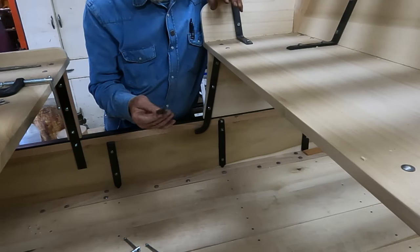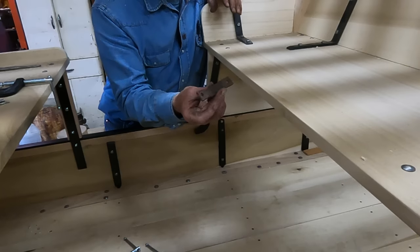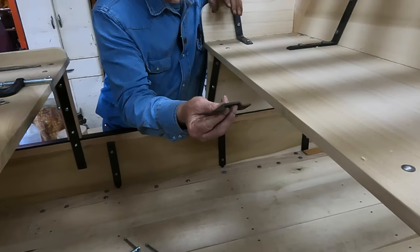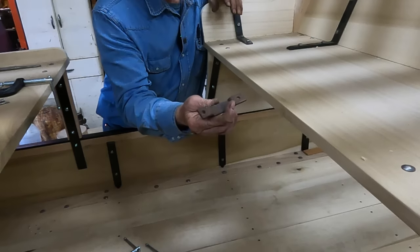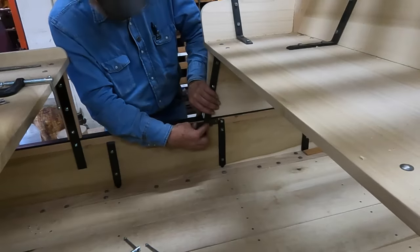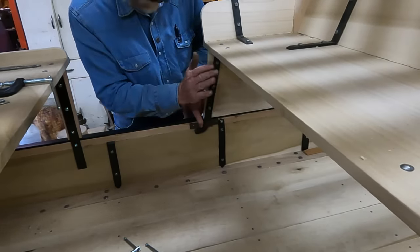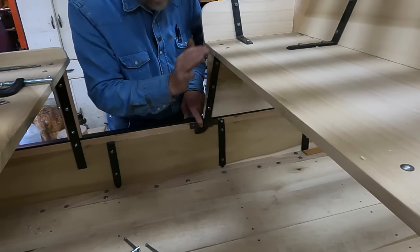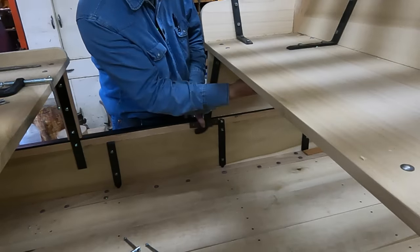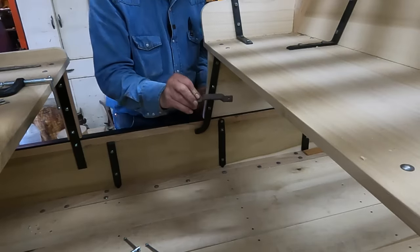So another piece of iron that I need to assemble is for this middle seat that is removable. And I have this little iron here that was original, still has the green paint on it. I'll have to duplicate the other one because I only have one. But I think it's going to fit right on this framework, and this little J hook will slide down into it. And with the hook, that's what will keep the seat in place as the pressure from the passenger is backwards. And then as it wants to be removed, when that time comes, it can be rotated up from the backside and released. So I need to make a duplicate of this.